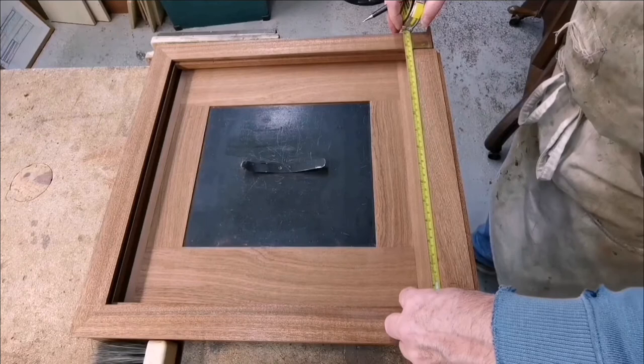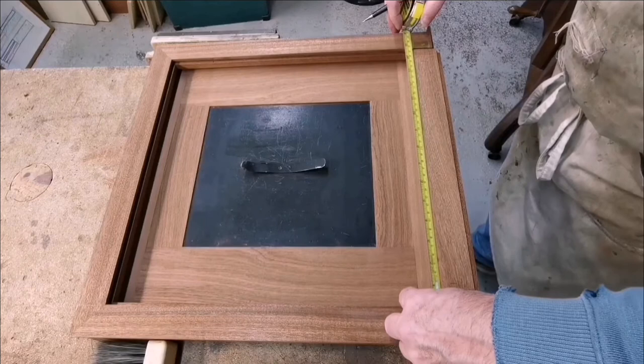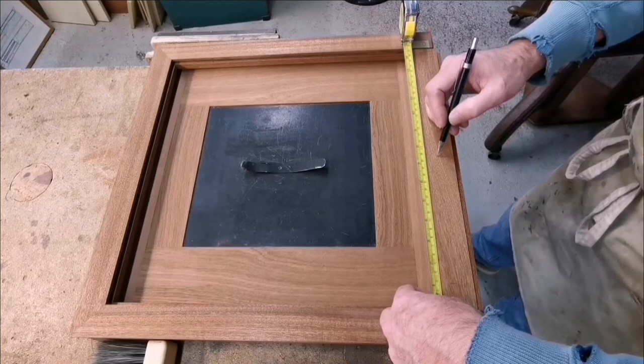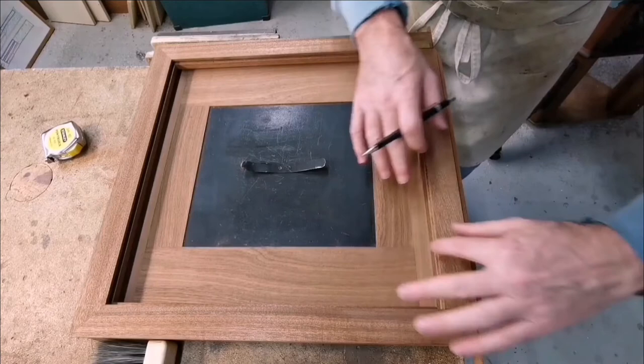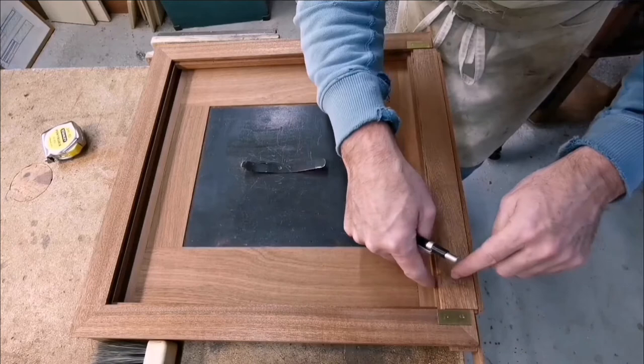What the makers did was they used to drill a hole here, screw through, dimple into the frame underneath, take this out, drill a hole, and then just cut a slot. Which means the screw sticking out goes up to there and stops at the end of the slot. Brilliant method of doing it. Right, I'm just going to do this here — three screws — and they're countersunk screws, so I'll just get the drill and sort those out.